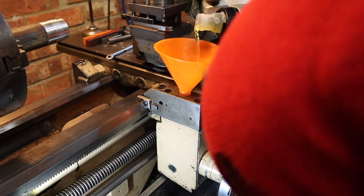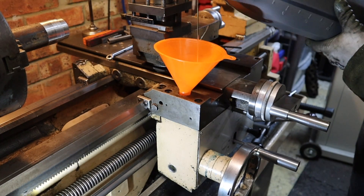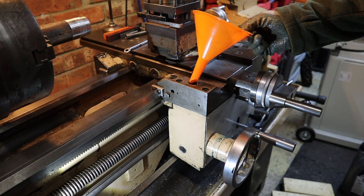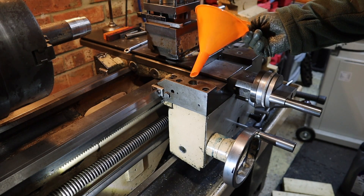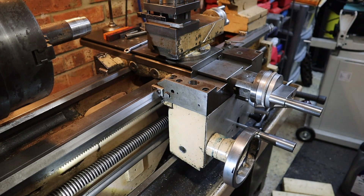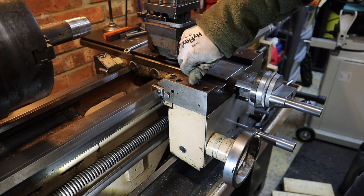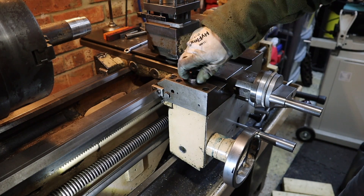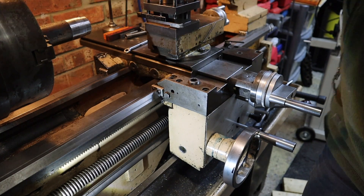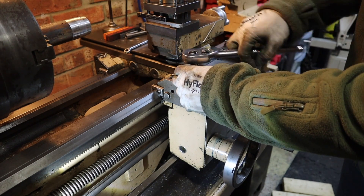It's now on the minimum mark — and maximum there. So I started off with the easiest one just to get things rolling, and that's the carriage oil all serviced. Next I'm going to move on to the headstock — get that drained out and filled back up. It'll be interesting to see what condition the oil is in there as well.